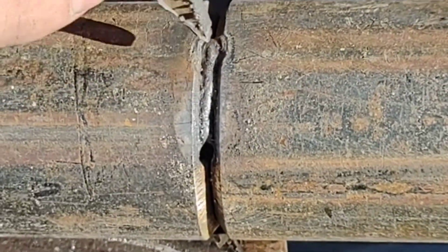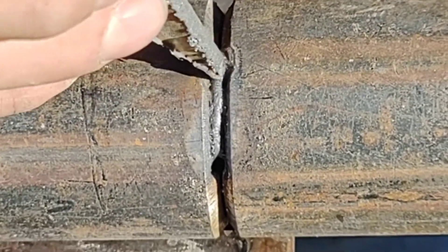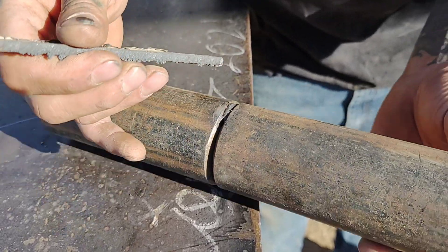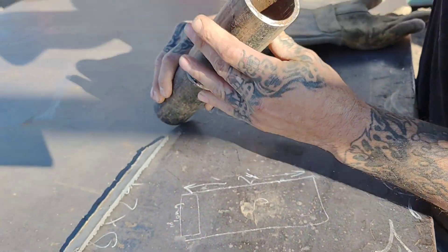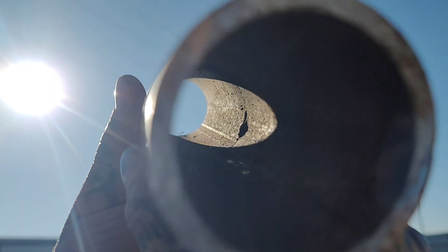What we're going to get into today is reading and understanding the tacks. You always want your bigger tack on the bottom at all times — gravity is going to come into effect, and you want something to tie into that's got a lot of meat. Let's see if we can get the light going on there. You see a quarter of an inch there — that's what I'm trying to talk about.